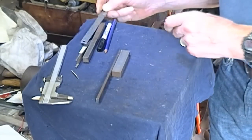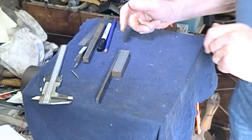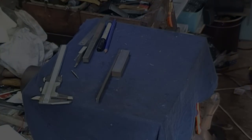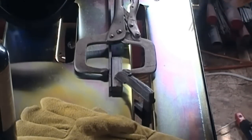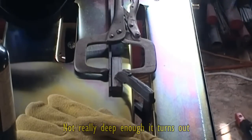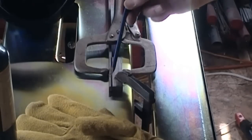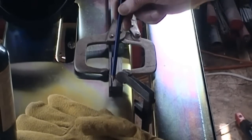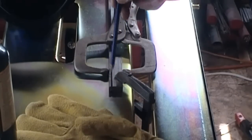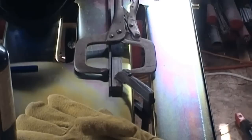The weld will probably be very functional. I'm somewhat disadvantaged with the old back at the moment — even standing — and when it comes to welding, that plus an unsteady hand doesn't always help. I've got a nominal 30-degree grind on each piece top and bottom. I'm going to try my smallest 2.5mm rod, run at 90 amps, and see how it goes. It's a pretty small gap to fill, and I'm going to preheat the larger piece because there's a big difference in mass. Take the first pass and then flip it over.